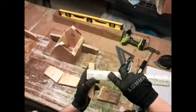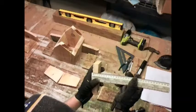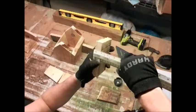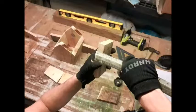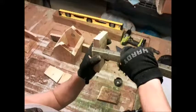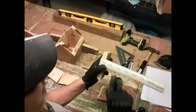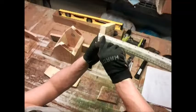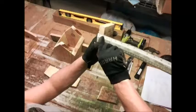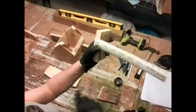So right here, if we're going to do centimeters, we got 2 centimeters wide, which in American is about 7/8 thick. Again, each piece of wood is different because it's just wood they put together for pallets. But you want to go down half. So I would suggest more like 3/8 to the center, or you could just do a quarter of an inch. Again, it's not perfect.